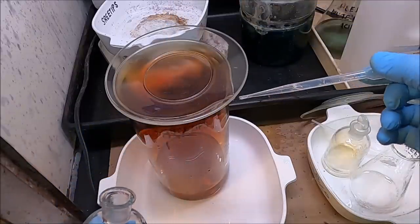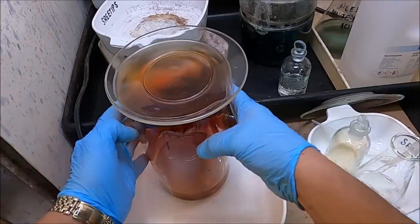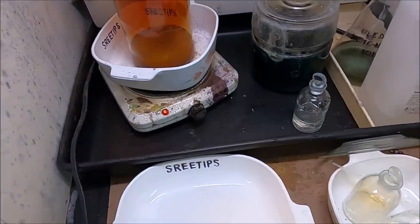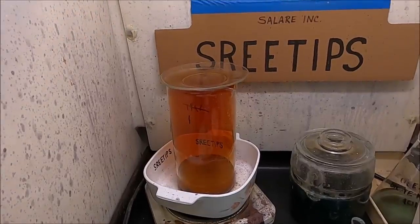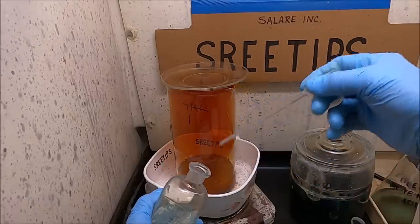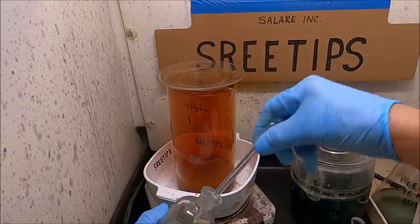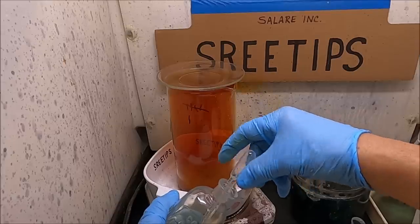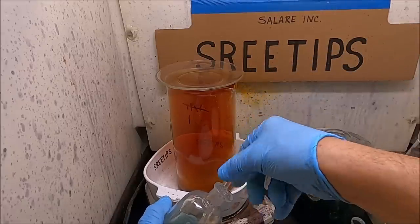Okay, here's a look at our gold — it is a nice brown color. Just like it is, we could melt that up and use it for new alloys with no further refining required. That would be very close to three-nines fine just like it is. Judging by the color of that solution we just poured off, this gold is going to be very clean.